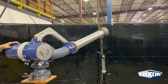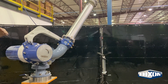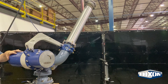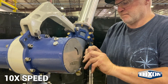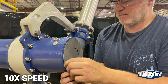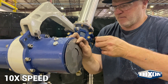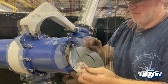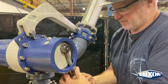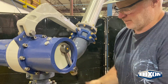If the adjustment bolt is in, take it out. Lift leg A until it reaches above the normal rest position of the loading arm. The higher the load, the higher above the resting position you should start. Take off the brand cap. Install the adjustment bolt into the adjustment cylindrical nut at the minimum position. You may have to spin the spring to get the adjustment cylindrical nut to align.